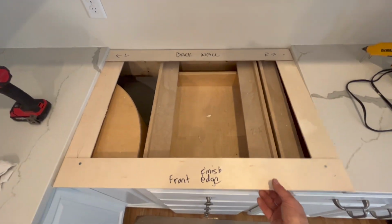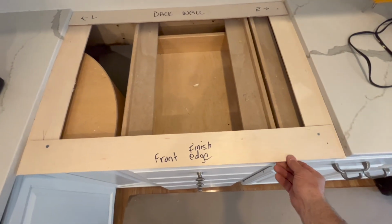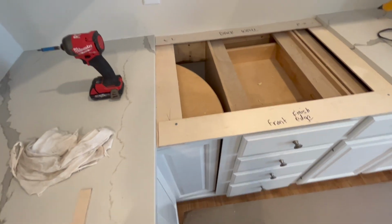Okay, so there are many varieties of butcher block that you can purchase, and I purchased a birch butcher block counter at Home Depot. As a carpenter, I was always taught, and learned the hard way really, that story poles and templates make for an easier, better fitting application when you're fitting parts. In this situation, using a template is way more accurate than trying to go off a tape measure and paper.